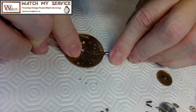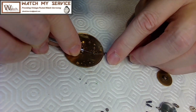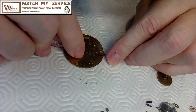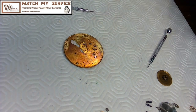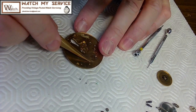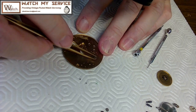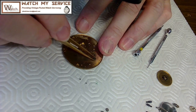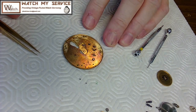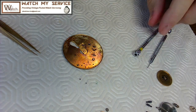This seems to be moving, which is always good. I just want to walk it out ever so carefully — and there's the cap for this watch. I'm looking at the surface of the jewel; it's clean as heck. If I look at the glare, there's just a little tiny bit of stuff on top of this cap jewel and setting.